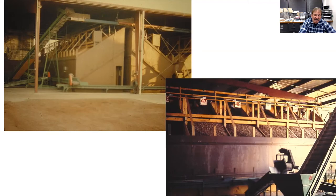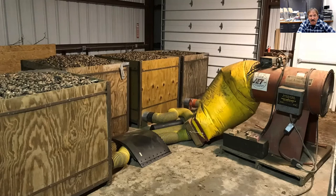For smaller growers, you can use boxes with a jet dryer and a scaffold manifold that breaks into different hoses to dry about 4,000 pounds at a time — each box holds about 1,000 pounds. As you move to a slightly larger operation with its own cleaning plant, you can have a drying bin with a jet dryer, then run pecans through a stick reel and air leg cleaner, then into the dryer, and out via conveyor belt into a sizer. That's a nice, efficient operation going from cleaning to drying to sizing all in sequence.